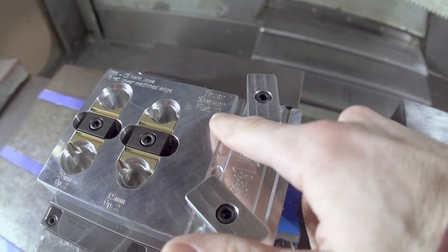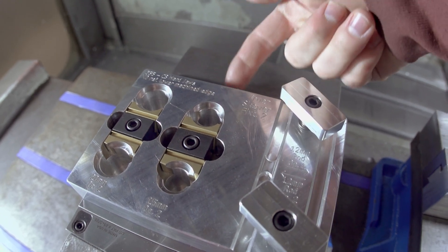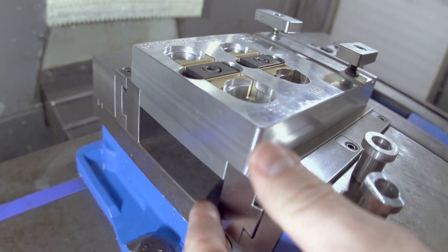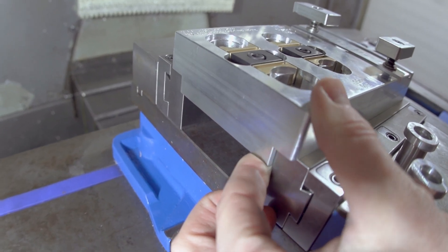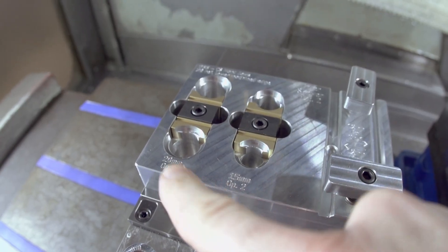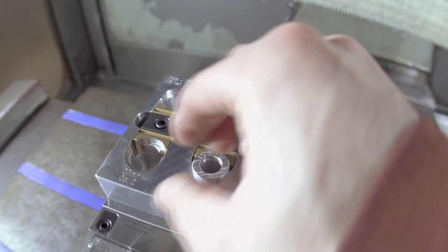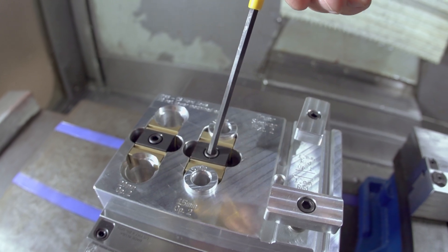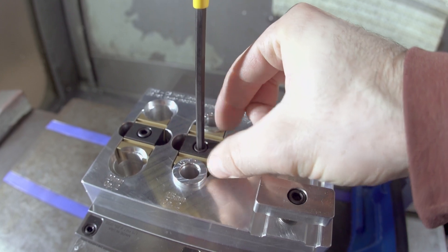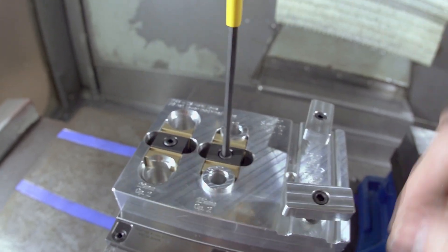The Op 2 fixture is slick. The notes say 'Truer Skewer Fixture 2, G55 Carve Smart hard jaws' — so we're using the Carve Smart hard jaws to hold this fixture. X zero reference is the lower machined edge, so when this is floating side to side, I can just take a parallel and make sure this thing is flush with the edge of these jaws. We've got 20 millimeter Op 2 and 15 millimeter Op 2 positions. The collars just slip in there, and when this screw is tightened down, this black piece drops down between the two gold pieces and wedges outward, securing the pieces so I can finish machining the top and do the engraving. Same goes for the 20 millimeter ones.